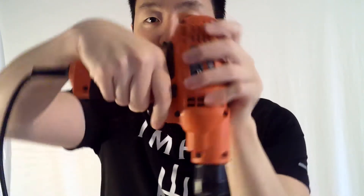When using the power drill, I recommend using two hands, one on the trigger and handle and one on the top. Always have the power drill perpendicular and straight to any surface you're working on. As a tip, slowly pull the trigger and increase speed as necessary.